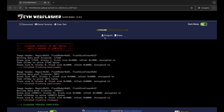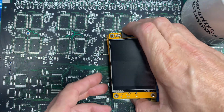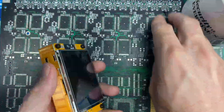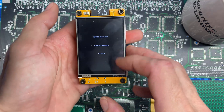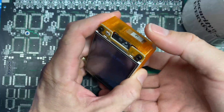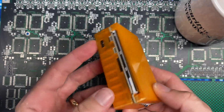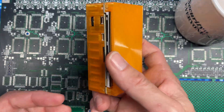With flashing complete, the last thing is to button it up — flip it over, push all the wires into place, and drive the four screws into the four corners. Turn it on and we've got the Marauder firmware running. Drop the stylus in, slap the top case cover on, and we're all up and running. Hopefully you now have a Cheap Yellow Marauder — drop an SD card in and get out there and start war driving. As always, stay tuned and thanks for watching.